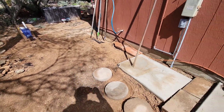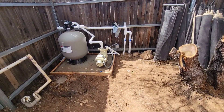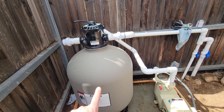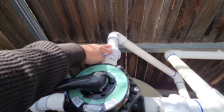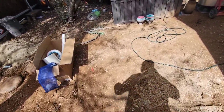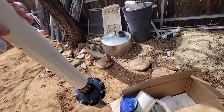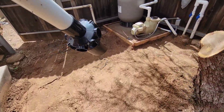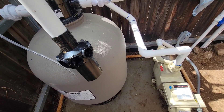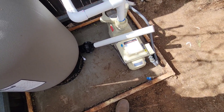Alright, check it out - a few days later. We went from having the equipment here - I showed you some clips on the plumbing, got the electrical ran, and we're finally here. We're finally gonna get down to adding the sand to the filter. I plumbed it all up, I'm gonna disconnect these and then add a little bit of water to the capsule. I cleaned the ring last night. The trick to this is that you put this in and then you reach in and add those laterals - I'll show you right now.